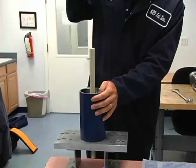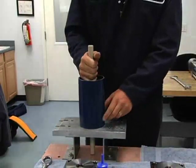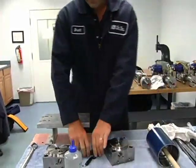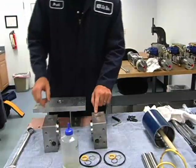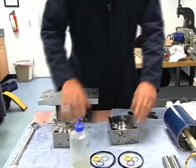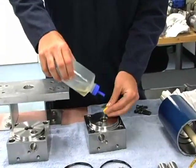I like to pound it down so we're in the center of the cylinder. We'll set this aside for now. Putting this piston plunger into the center of that barrel just makes it easier for assembly later. Next we have our end bells — we have a left and a right, and this is due to the oil passages on top, so we always need a left and a right. We're going to start by putting in the oil seal in the center here — this is going to ride on the plunger and keep oil into the cylinder.